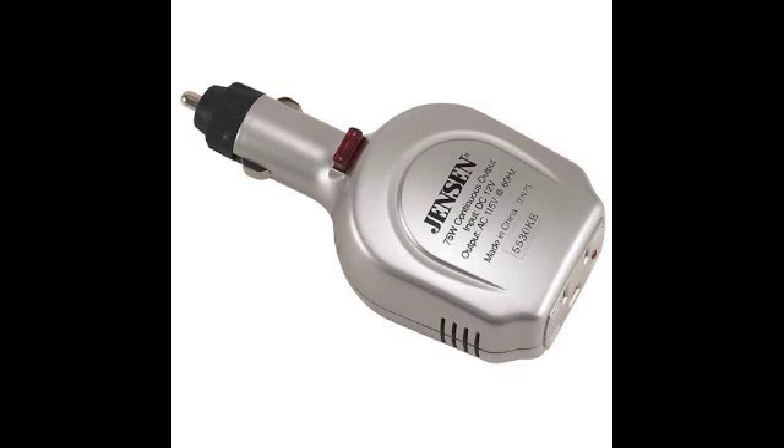You're going to need to purchase one of these accessory inverters for 12-volt — they're used for cars. Walmart has one for $14. You can tear it apart, get the circuit out of it, and re-box it, or you could use it as is. Basically, you're going to use the 12-volt in and the 120-volt out for the pump.